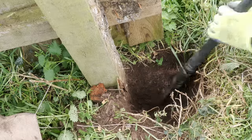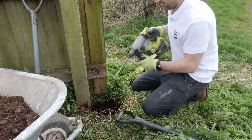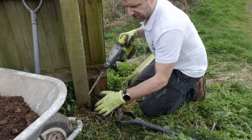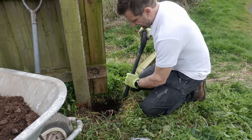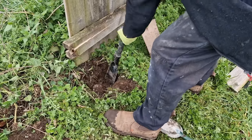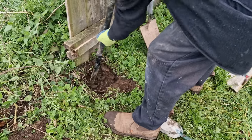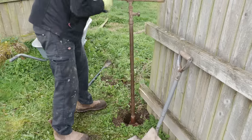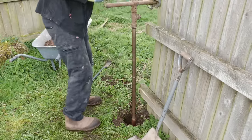There's a stone in here and I'm using a combination of my SDS drill to get so far, and then this tool to actually break up the stone. It can be a slow process, particularly for a repair like this where I'm digging close to the previous hole that was filled with concrete — but you just have to be patient. The other thing I love is this brilliant old-fashioned digging tool, because particularly for stone-free ground it cuts lovely round holes perfect for the post, and is much better at excavating soil than a trowel.